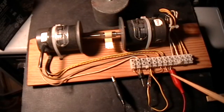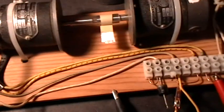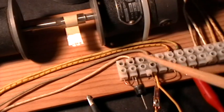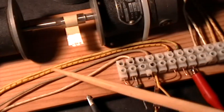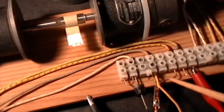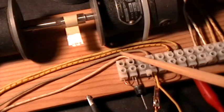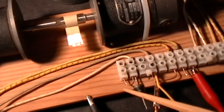So right now the way I have it wired is — you can see it a little bit better — remember these are the armature wires and these are the field coil stator wires. So in to the armature brushes, to the commutator, back out, and then in to the field coil, back out, and then here's where I'll connect the black negative lead of the power supply.